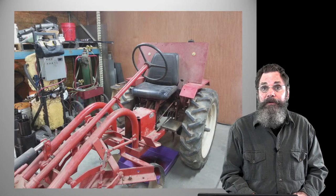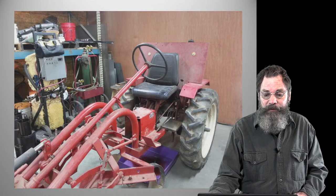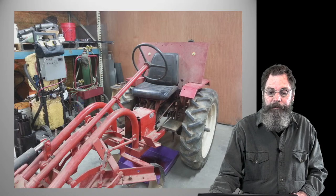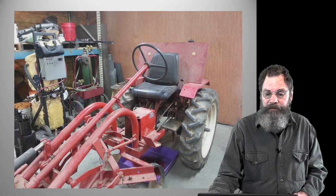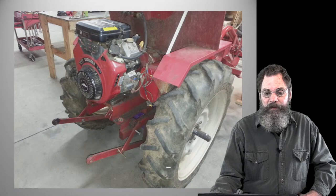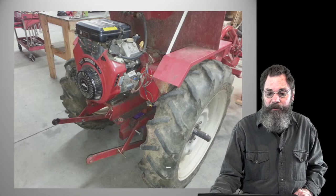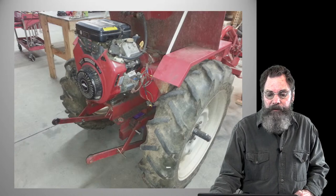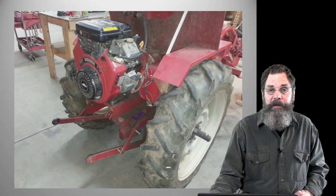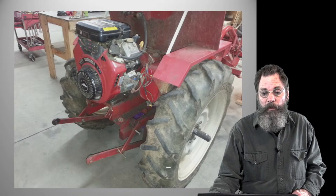This tractor had been used and modified quite a bit to suit the previous owner's needs for what he was doing. We changed over the toolbar in the front and did some other things, but of course, the big changes were in the drive system itself. So you've got a 2-cylinder, 16 horsepower engine that was originally in the tractor. It's in the rear, of course, and it drives forward. There's your lift bars, your three-point hitch. It will be a three-point hitch when I get through with it, but that can be electro-hydraulically controlled as well.